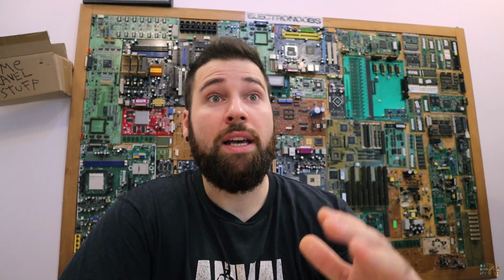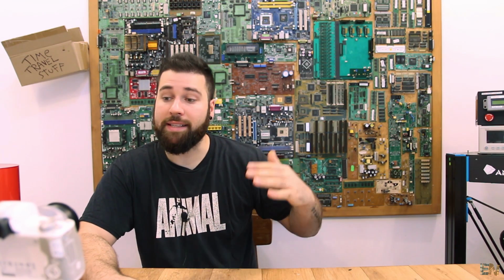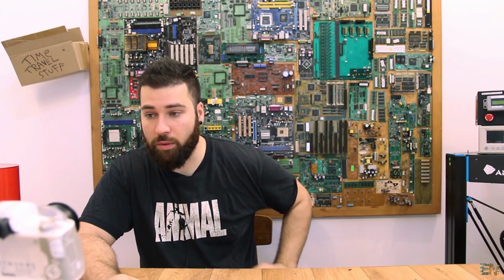I already have a PCB that should arrive soon from JLCPCB. But you see, if I fail anything on that PCB, I'll have to make a second version. I'm not sure when I will have that project yet, because to boost the voltage to 48 volts I had to change a lot of the circuit, because the drivers and the MOSFETs were only for 24 volts. Now for 48 it's a lot more difficult. The voltage regulation as well will be more difficult. The tracks of the PCB have to be a lot thicker and so on. So maybe next month we'll have that project, but if I have to make a second or a third version, I'm not sure when I will release that video. Maybe I will release a first part with the project on the breadboard and then the final PCB.